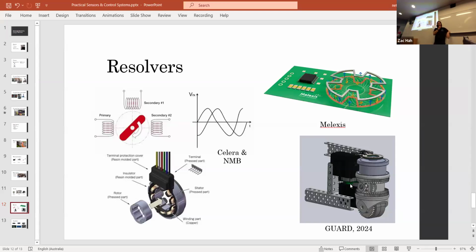Definitely take advantage of the fact that you can talk to each of the motor controllers or devices on the CAN network, and you can go through each of the IDs. It can be helpful, for example, to write down what CAN IDs are what position in the daisy chain, so that you can find, I can talk to this one, I can talk to the next, I can't talk to the next one, so there must be a missing link in between. Apart from that, you can use a multimeter and go and test things out. Yeah.